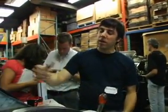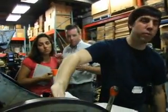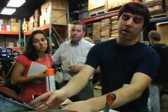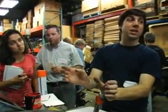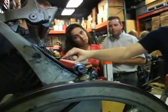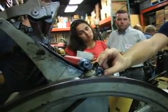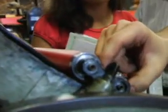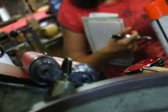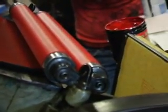If your rollers are running low, some people add masking tape to the rails that the rollers roll on. Some people will put type high rules into the form to lift the rollers up to type high to stop them from squishing into the type. Because you can imagine with all that movement on these parts of the press, these wear down at a somewhat rapid rate. So your rollers are supposed to be the exact same diameter as these roller trucks. So as rollers swell or change or these wear, you run into a lot of problems with form roller height. And then your ability to get quality printing starts to get a bit shifty.